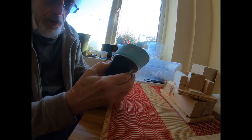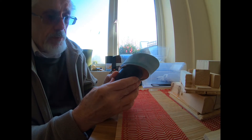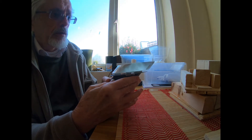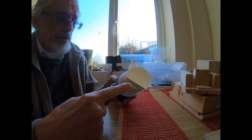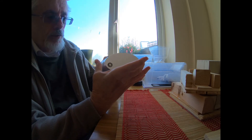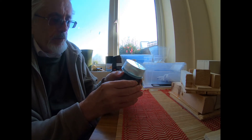This is a nylon support. Now, the reason for doing this — when you put the secondary into the telescope, to be ideally positioned it is offset in one direction. So the centre axis for the tube is here, and that axis is not balanced equally in the tube — the whole secondary is pushed over in that direction for reasons which we might explain later.